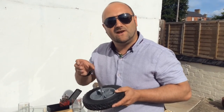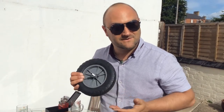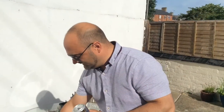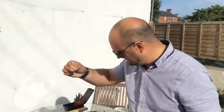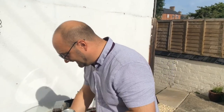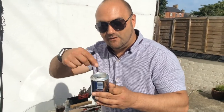We're hoping we can fix the concentricity by adjusting the angle of its settling position, and the fillet of glue will take up the extra space — we hope. We've got our Araldite, taken a little cotton bud and cleaned the inside of the spigot receptacle we've just drilled out.